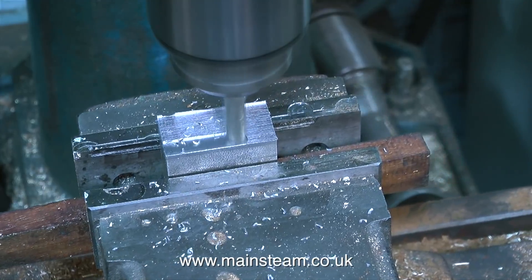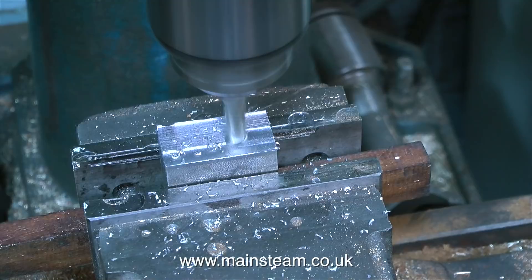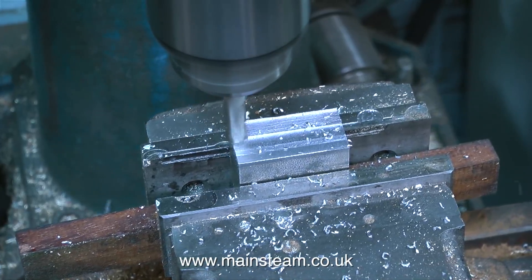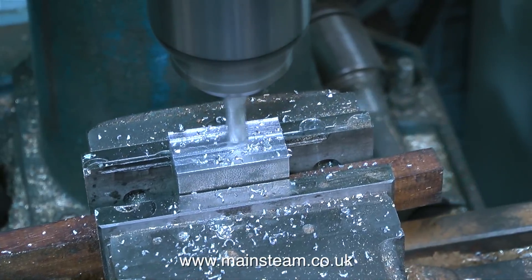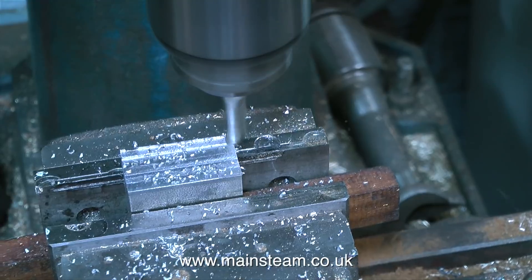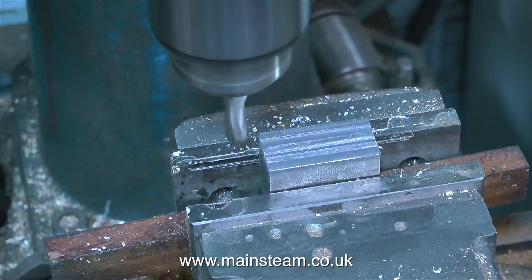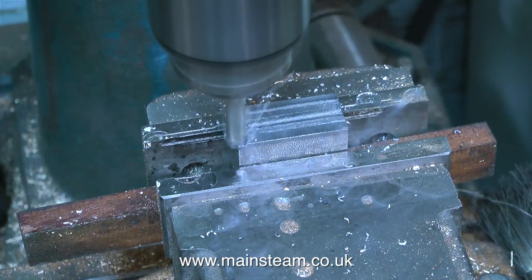I'd like to take this opportunity, whilst the milling machine is doing its thing, to apologise for the sound on this video. Currently I'm recording this voiceover in the studio, but there are a couple of machines on doing a major backup of about half a terabyte of data, which appears quite significant whilst it's going over the network. You're currently watching me milling the top of this steel block. The milling cutter is in my very old Jacobs chuck, which is very stiff, never works loose, and is just convenient to clamp in. I could use an R8 collet or even my Clarkson milling chuck, but for general bits of milling this is perfectly acceptable — I just put the milling cutter in the drill chuck, tighten it up, and it never works loose.